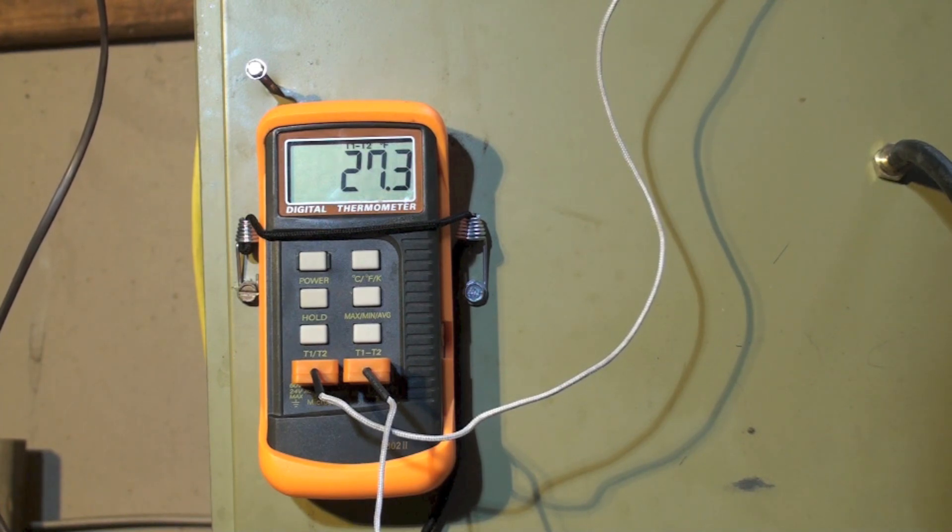Because the indoor coil is not matched with the outdoor unit, it doesn't operate as expected. I have a 25-foot line set, which is probably right for this unit — they typically figure about 25 feet minimum for the factory charge. All I've done is taken the factory charge and added 5 ounces for an aftermarket dryer.